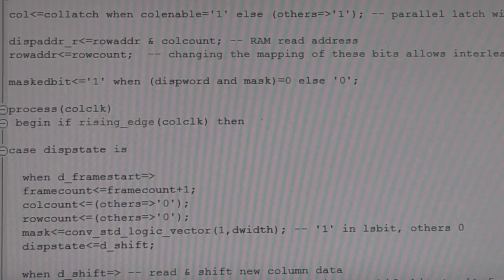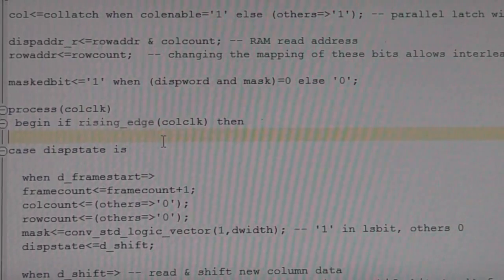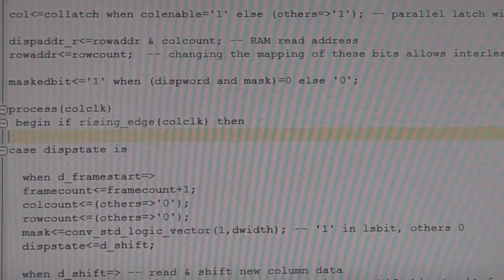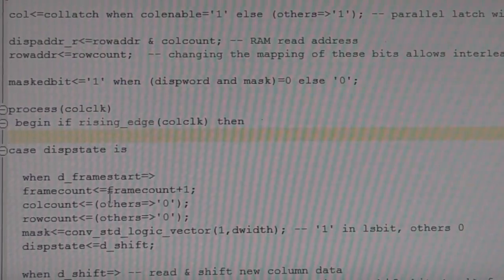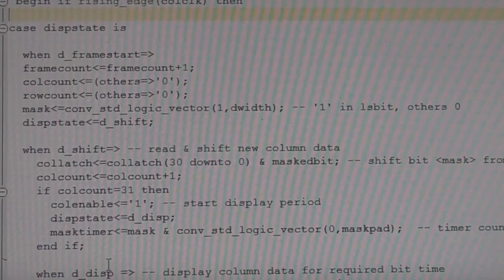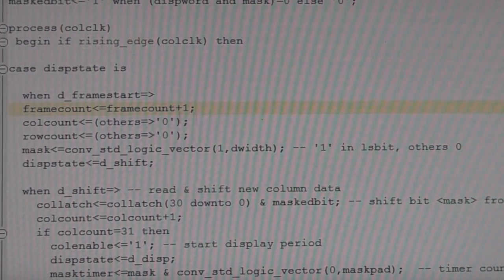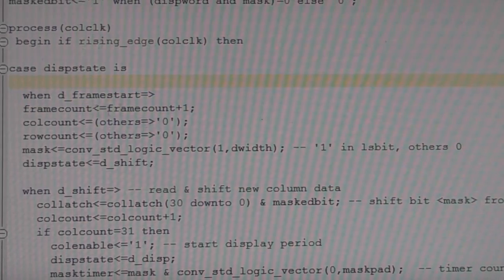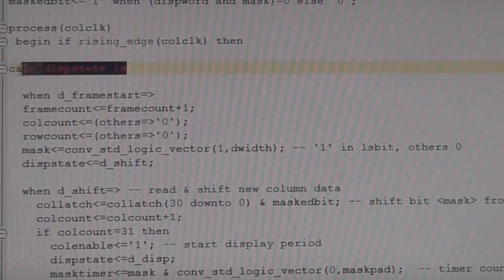And because everything in here is within this rising edge thing, that's the standard way of creating a clock system. So what this is effectively generating is a great big latch with all these various values latched on each clock, and the input to that latch is this priority logic. For example, it will be generating an adder, taking the output of the latch, the five latch bits corresponding to this, and feeding them into an adder, the other input of which is one. And because we're inside this, this case acts almost like a multiplexer.